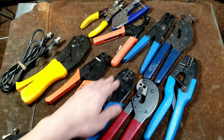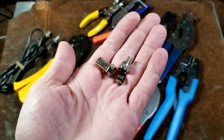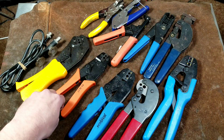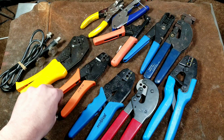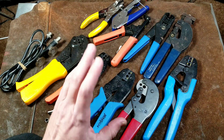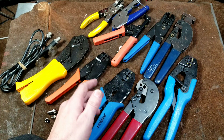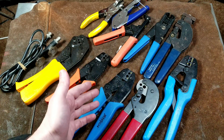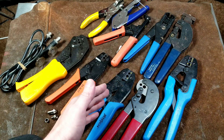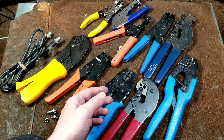The compression fittings versus the type of fittings you might find at Radio Shack or another electronics store — those store fittings are what you'd find at an electronics store. But when a cable technician comes, they're installing thicker, heavier-duty cable ends with little blue rings or collars on them. Those are compression locking terminals, and they have since replaced the hex crimp terminals in most instances, because they're faster and tend to be more reliable, or less prone to user error during installation.